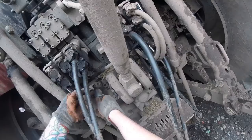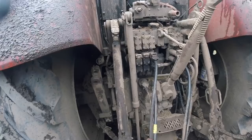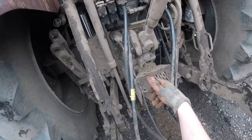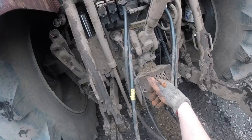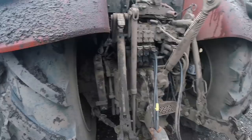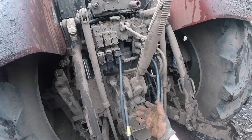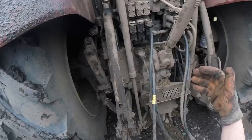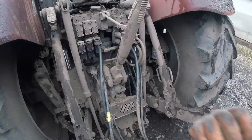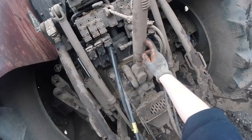Something I do — I'm actually taking this trailer off once I finish filming this. Sometimes you think they're in but they're not, and what'll happen is they'll fall out on the road when you hit a bump and get a terrible case of road rash. Then when you get to where you're going all the bayoneted fittings will be worn down and you won't be able to do anything — then you have to call your manager and say you need new fittings. I've done it, everybody's done it. So what I do — got myself in the habit — when I first get back in the tractor I'll just test everything. I'll lift the trailer up a little bit, make sure that comes up, open my back door, close it again. If any of those functions doesn't work, there's something not plugged in properly. Come round to the back and more often than not one of these will just be hanging loose. That's a bit of a tip.